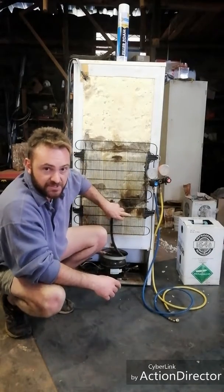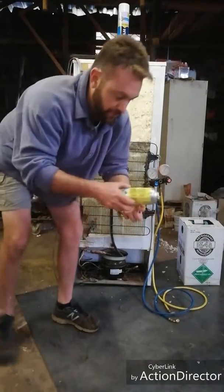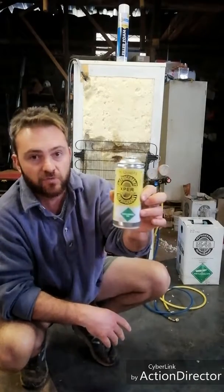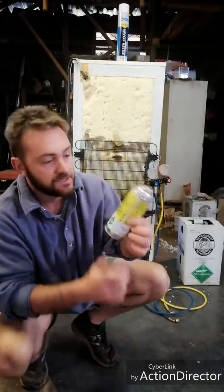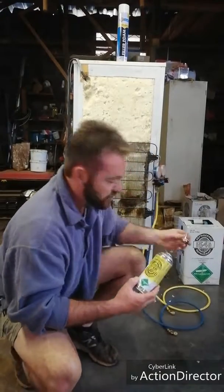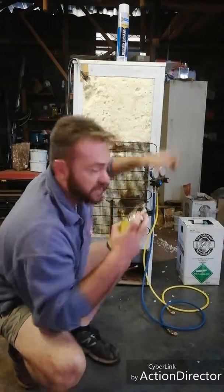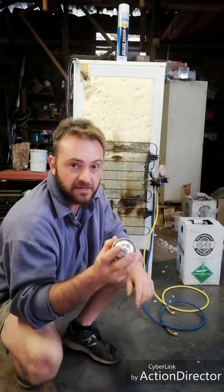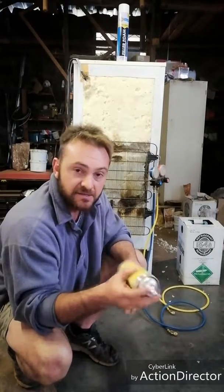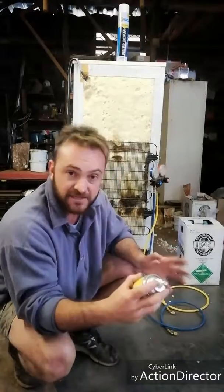You can find this high-quality expert refrigerant flush — you buy one of these nozzles, it clips onto one of your pipes, and you just push this and circulate it through the pipes. This cleans out all the rust and anything that's stuck inside the pipe. So that was the first thing I did before I started with anything — I flushed the system.